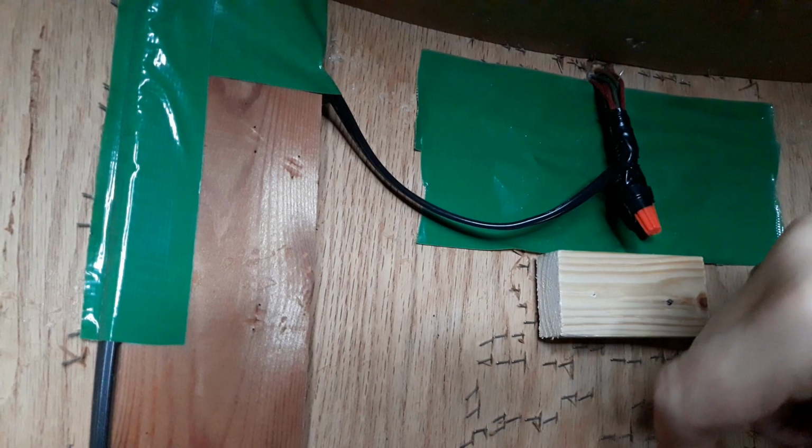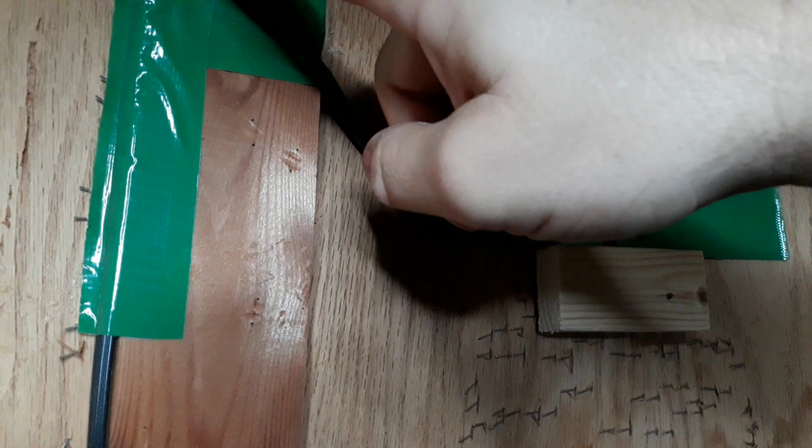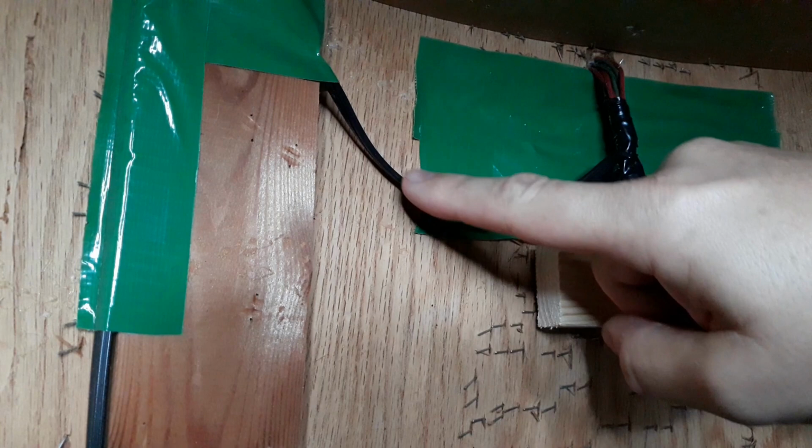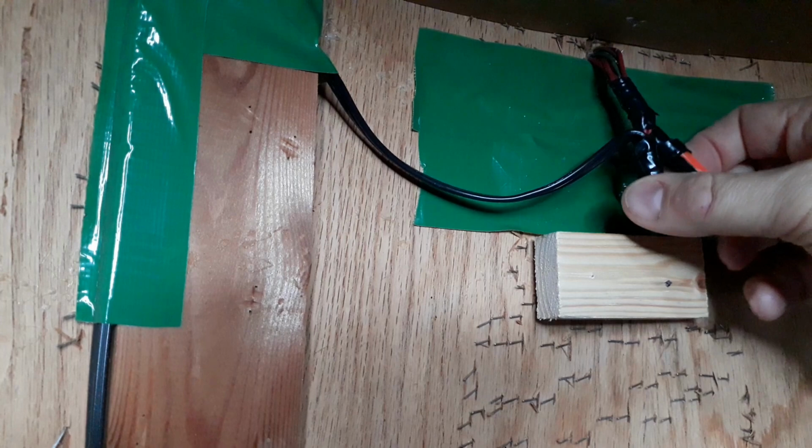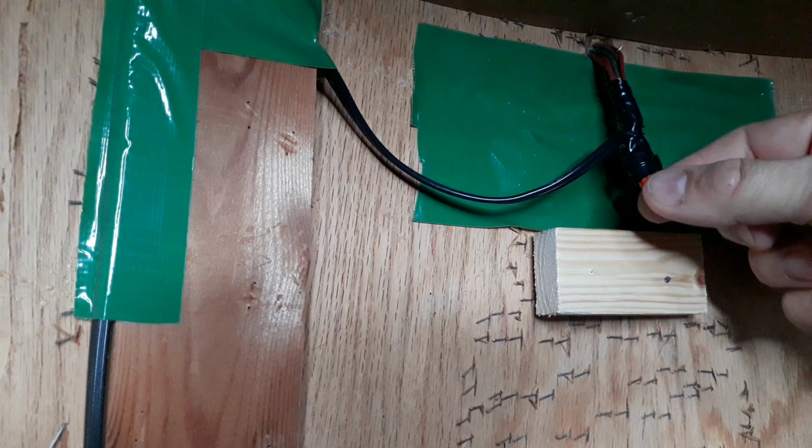So you can see I've completely replaced all the wire. One wire is going directly up into the switch box below. There is a switch and second wire coming down and tying into the eyes of the Tiki. And I used some basic standard wire connectors here. Tied the wires together, twisted it, and then sealed it up with the electrician's tape.